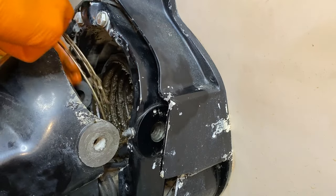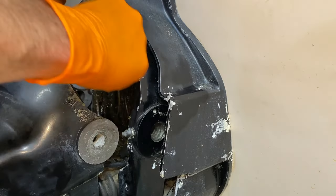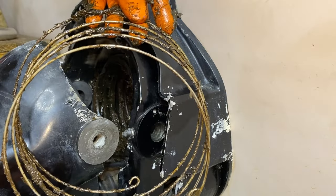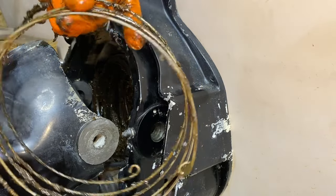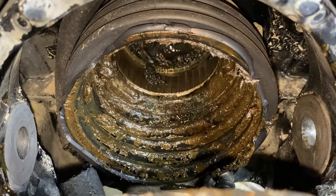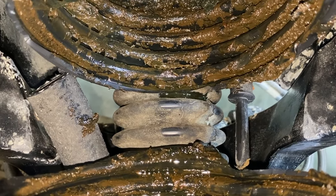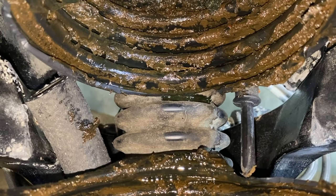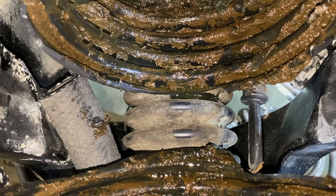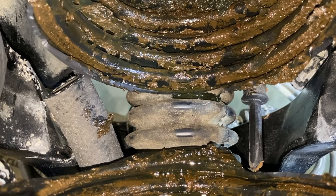You're going to get a little dirty but that's okay. There is the ring inside the entire U-joint bellows — very greasy and dirty. Set that aside. There is the U-joint bellow we just cut — it only took a few seconds. Down below is the exhaust bellow, and to the left is the water tube we already cut. If the adhesive is giving you trouble and you're unable to pull the exhaust bellow off the inner housing even after loosening the clamp, grab the utility knife and cut through that exhaust bellow as well.